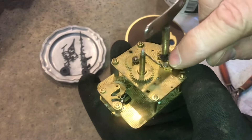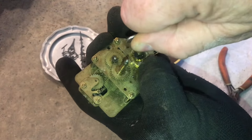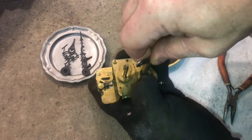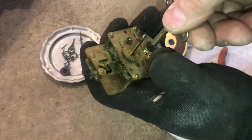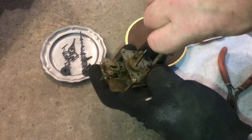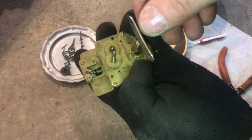You can see that I wound everything back about five clips. We'll do the same procedure — I'll pull the tension off of the click and just keep unwinding it like that. You don't want to unwind everything too fast; you want everything under control. I'll take my time and unwind it very carefully. There's absolutely a lot of tension on this thing, so just take it nice and slow. Now we can feel that all the tension is completely off.